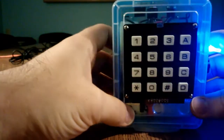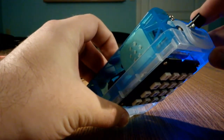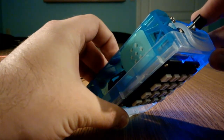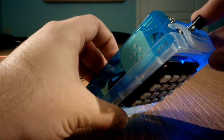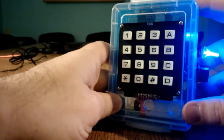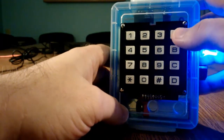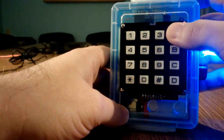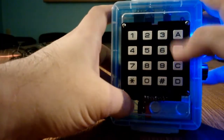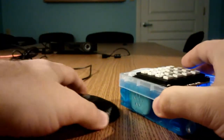Also, the supervisory signaling is a lot different as well. This is 2040 Hz and 2400 Hz at the same time, then without pause, another either 2040 Hz or 2400 Hz according to the specification. So that's all of the differences as far as firmware goes and hardware goes. To get it back to domestic mode, just hold A and you'll hear one tone. That just means that it's back to domestic. So let's go ahead and test the internal speaker, the SD150.